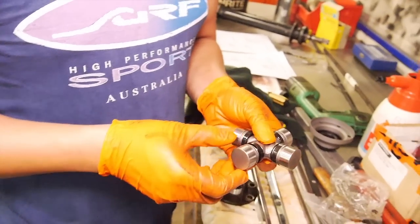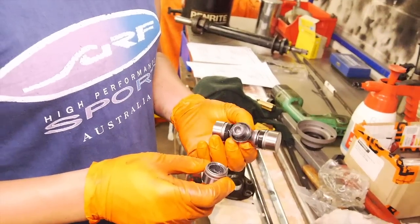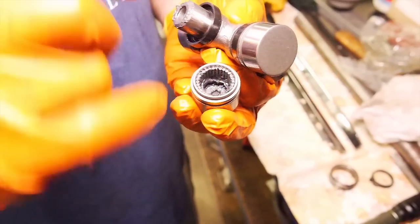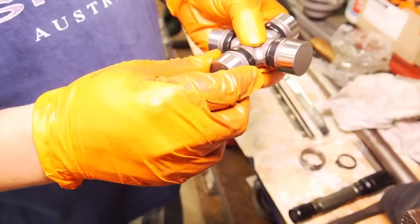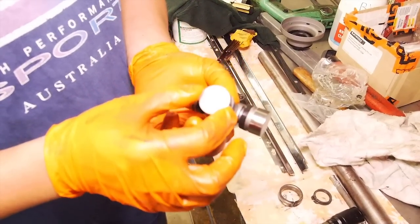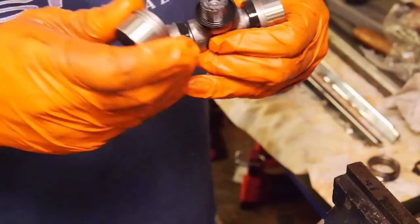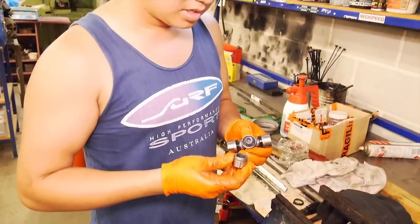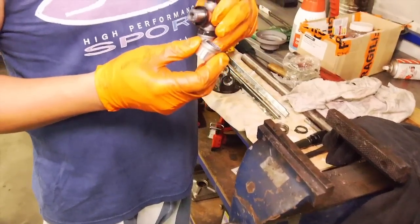A good lesson anyway - a story about bearings and uni cups. When Chaos Chris was rebuilding the uni joints in his Land Rover, one of the needle rollers became dislodged and ended up lying across the bottom of the cup. He proceeded to fit the bearing and was pressing it the last little bit using a pressing tool, supporting around the outside. There was an almighty crack - that stray roller had positioned itself across the end of the cross shaft and fractured the end of the brand new needle roller. So be really, really careful you don't dislodge any of those needle rollers when assembling.